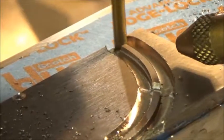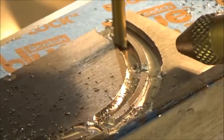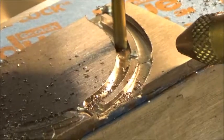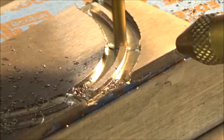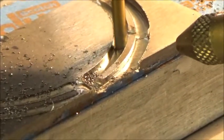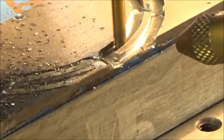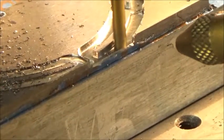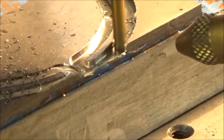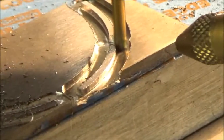Okay, this is going to be another short clip that I'm going to tack on to the first video I shot, if it works out. I'm pretty much convinced at this point that the setup with painter's tape and super glue is probably just fine. I'm thinking that the end mill might have been creeping slightly up into the collet as a result of maybe not having the collet tight enough.